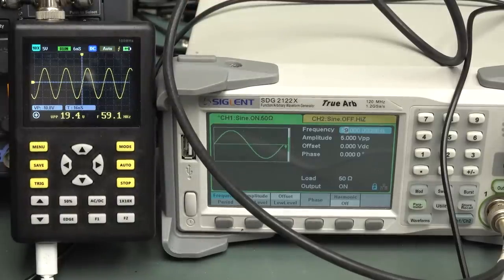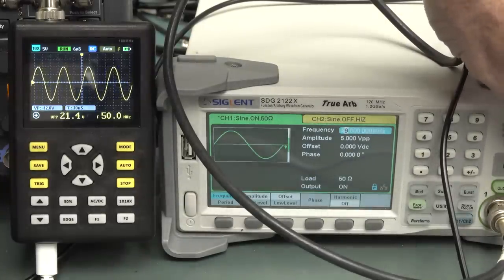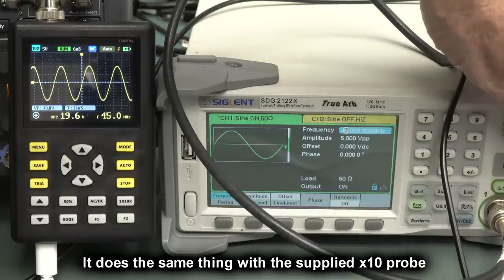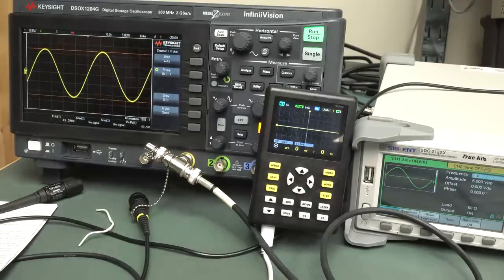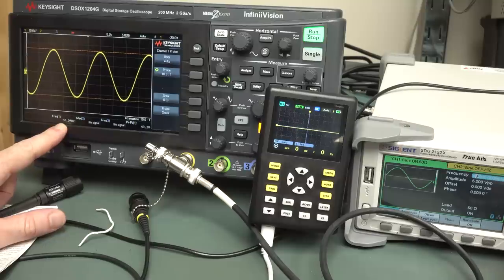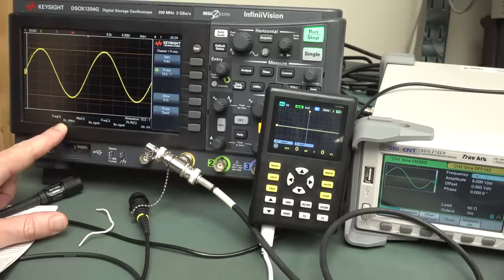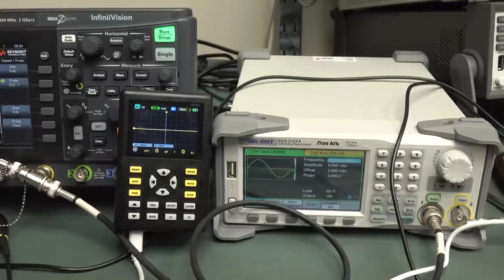We're taking all the cables out of the equation, and watch this. If I lower this frequency, we'd expect that amplitude to stay pretty constant. But look, it jumps all over the shop like that at about 45 megahertz. Crazy. And just to prove to you, that's not my function gen. 57 meg, drop it down. 50, 45. It's rock solid. There's nothing wrong with that gen at all. So, it's this puppy, and it is one sick puppy.